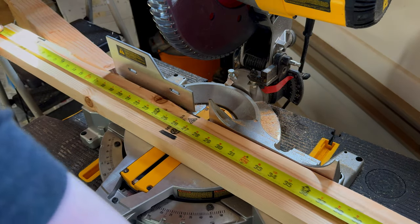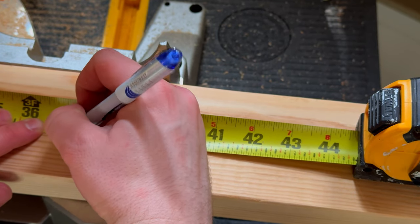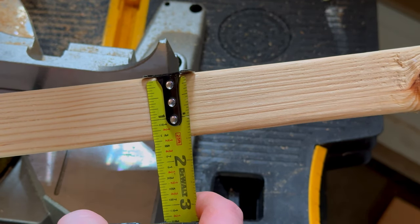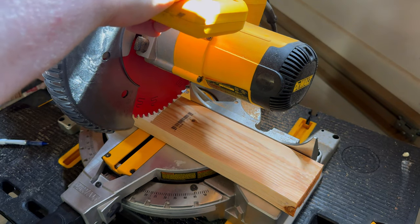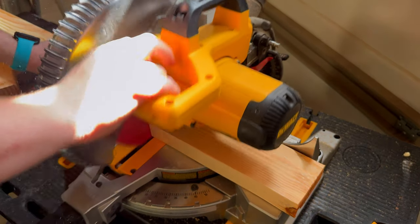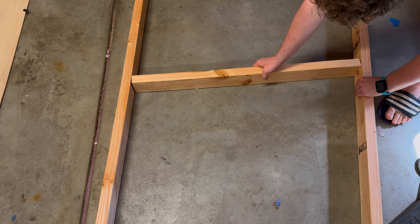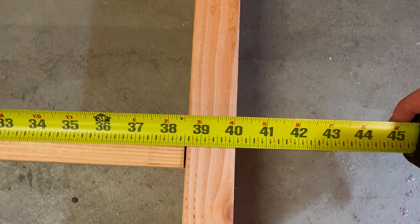With the four main pieces cut, the next thing I'm going to do is work on the width pieces — the pieces that go across the stand and hold the shelves on top. The width of mine is going to be 40 inches. However, I want to cut them down to 37 inches, because this piece will be in between the two other pieces and two-by-fours have a thickness of exactly one and a half inches. Therefore, accounting for this thickness and cutting the piece a little bit smaller, putting it in between the other two pieces will give me a length of exactly 40 inches. Once you've calculated your measurements, go ahead and cut the piece to size. I like to do a test fit to make sure the piece is the correct length — as you can see, a perfect 40 inches.